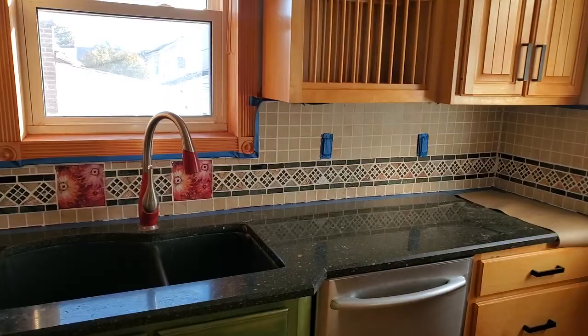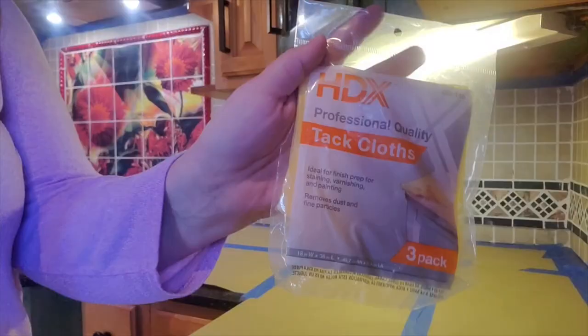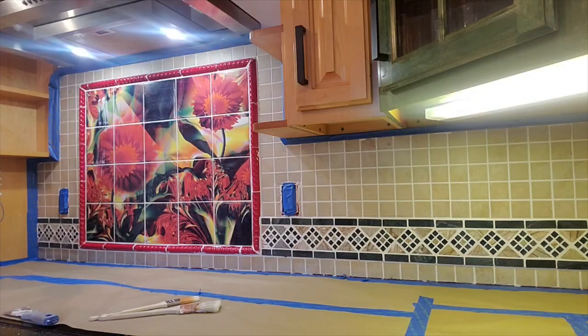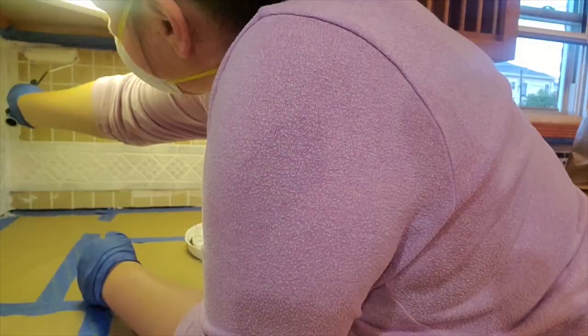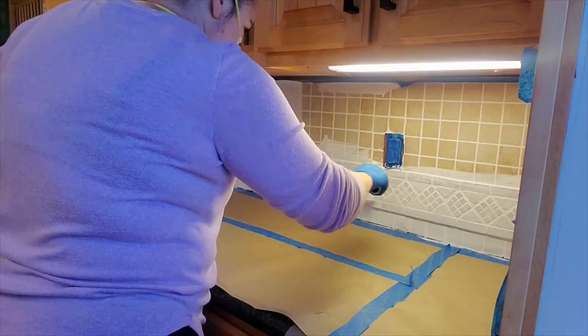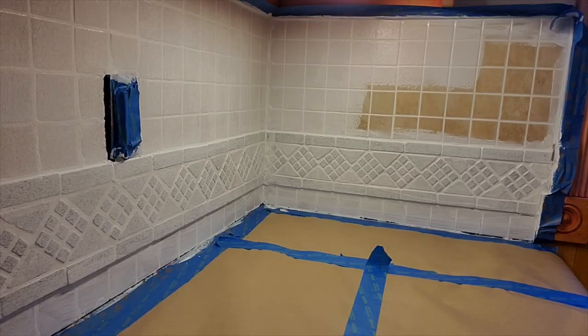De-grouting was so messy, but I was happy to have those experiences. After I re-grouted, I felt a lot more confident — naively — that the red would be gone and I'd be fine. I figured I could skip the degreasing steps as I started over in preparing to paint. I did tack cloth, but that felt like a waste of time because it kept getting stuck on the sanded grout. There wasn't really much red coming up on the tack cloth, so I stopped. I then painted a coat of Kilz over all of it — we had some left over from our renovation. I was pretty surprised with how much the Kilz already coated the tile and I was really happy seeing the backsplash start to lighten. I figured one coat would be enough to seal the red grout. I should have done another coat, but I proceeded with the paint.